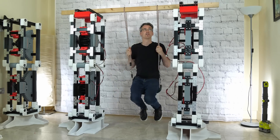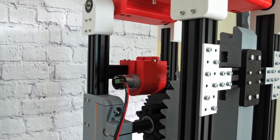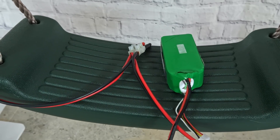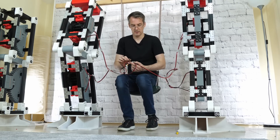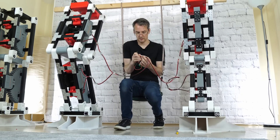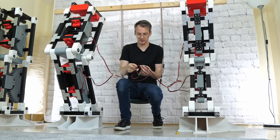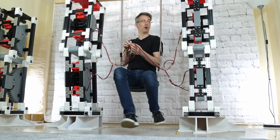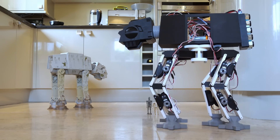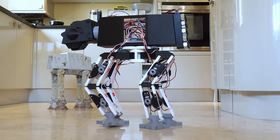I've put a piece of wood across two legs using a kid's swing frame — they're strong enough to hold me when upright, but can they lift me when they bend down? I've wired all the motors together with chocolate block connectors and a battery. Let's see what happens — oh yeah, that's more than strong enough. There's no position control yet so once it goes down my mass keeps pulling it, but eventually we'll have feedback and it will all be servo-controlled to hold position. That's got no problem lifting me at all. In practice it will never need to lift me on two legs — the most it'll need to do is push three legs backward while one foot comes forward, using inverse kinematics. You can check out more about that in my video on the small AT-AT.